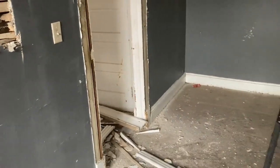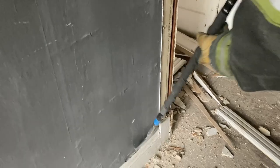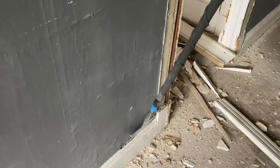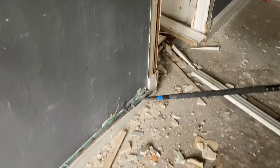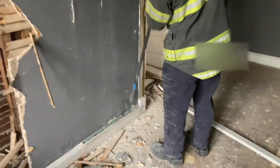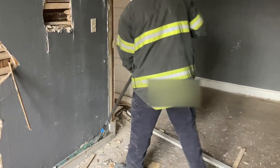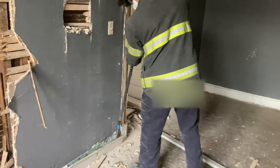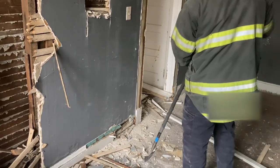So with the Hartford hook, you've got the head that it's a blade style. So you're basically gonna run it down the wall, pierce the baseboard as best you can, drive it down hard, and then slowly work it away from the wall. And away it comes.